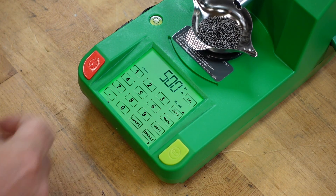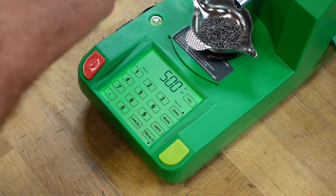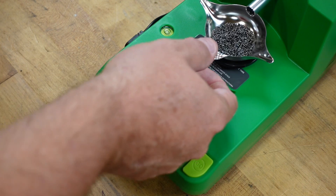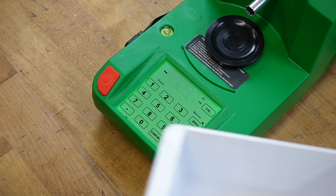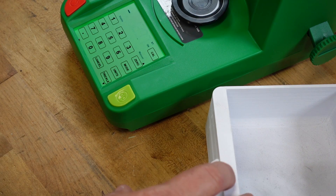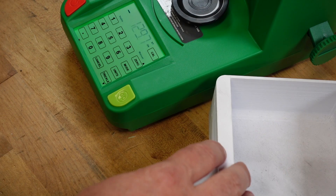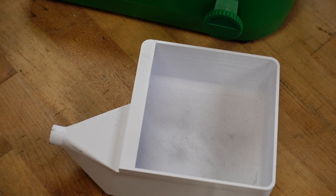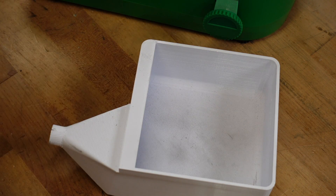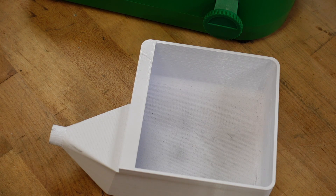We are done with our charges and we want to get the powder out of there. First, make sure you hit cancel — that's going to make sure you don't accidentally lose powder somewhere. We can put the powder back in temporarily. I happen to have this little 3D-printed collection unit to put powder into. If you want to be really safe, you can turn the unit off. Remove the weights so that if you rotate it a little too much, they don't accidentally fall out. Make sure to put the rubber cap on to prevent any more powder from coming out.